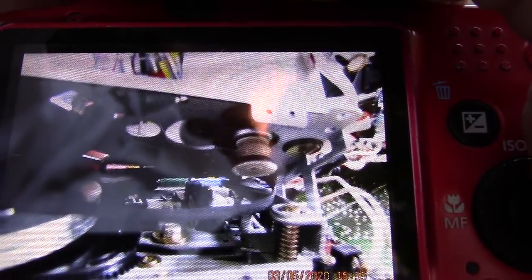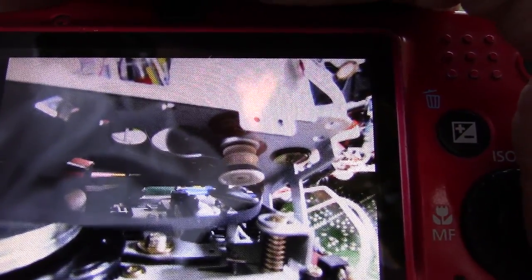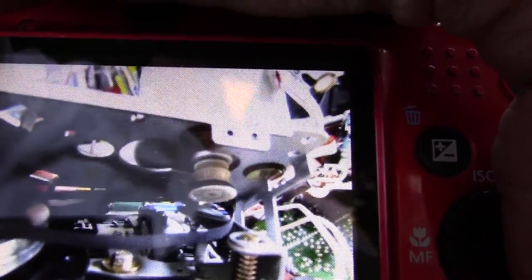Now, I know you probably can't see it terribly well, but in this picture here, that motor drives a small square belt at the bottom. And then on top of that is the flat belt. There's another picture of the motor — again, the flat belt's on top and the square belt's on the bottom. So you have to put the square belt on first, with the flat belt on top, and then put the flat belt on while maintaining the square belt on. Got it? Got it.